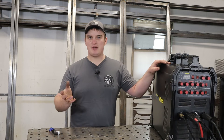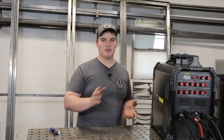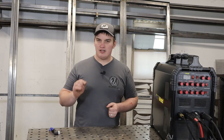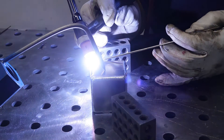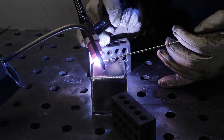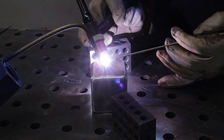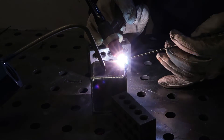I'm talking about real thin sheet metal. If you're welding 1/16th inch or 16 gauge, you're going to be fine, but anything less than that you'll have to use some techniques so you don't burn it out on just the startup. Once that arc gets started and you're rolling into the pedal a little bit, the arc levels out and it welds beautifully. The other thing I've noticed is it has a little bit of a hard time finding its ground on the AC side. If you stick your ground clamp closer to your project it definitely helps, but it's just not as definitive as some name brand machines where I can have the ground on the other end of a 20-foot table and it finds its ground right away. You've got to commit to that pedal a little bit for it to find its ground and strike up.